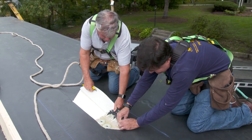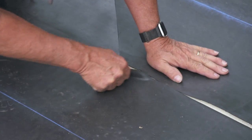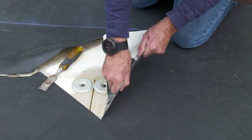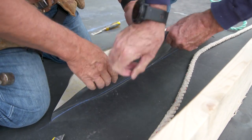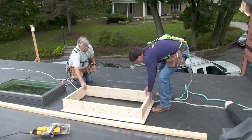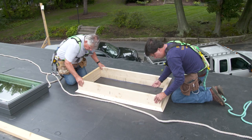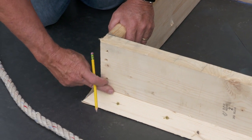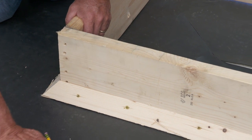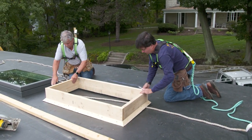The thing about this glue — it holds. Now we're actually going to pull this back, but we're going to have to cut a little further out to make room for the thickness of the curb. Alright, that's loose. We've got to peel it back even more, but let's lay the curbing on there. Now with this skylight, it actually requires that you build your own curb to sit it on. And because this is such a flat roof, we made the curbing out of 2x8s. So what I want to do is mark the outside of the miter of this bevel piece. I like to put this bevel piece on the curb so when the rubber comes up, it doesn't have a real sharp 90.